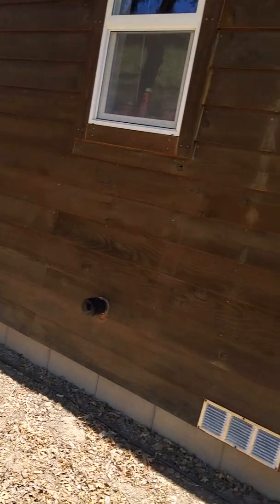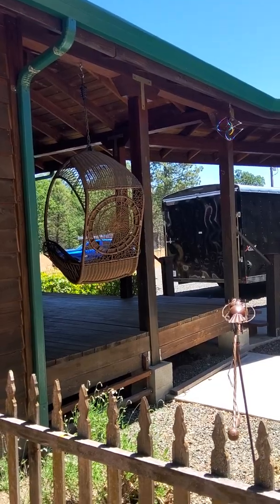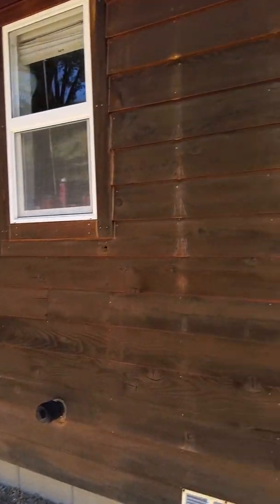It's probably going to cost around $15,000 to $18,000 to do. I always recommend tearing off the original roof, which you actually have to do with this kind of roof. It's a dimensional roof, so you have to tear it off and put a new roof on. Okay, so let me see. You've got 2-point ventilation: a ridge vent and an eave block vent.